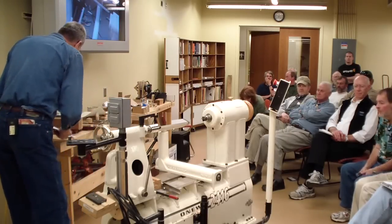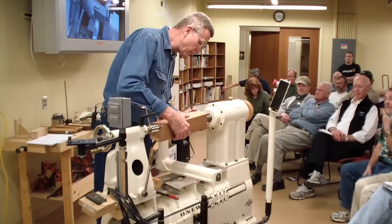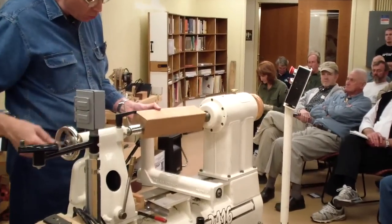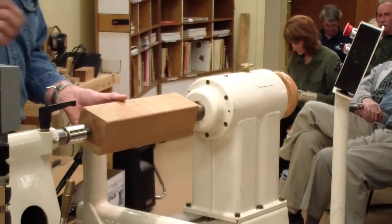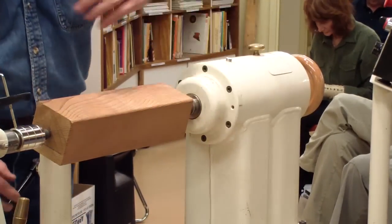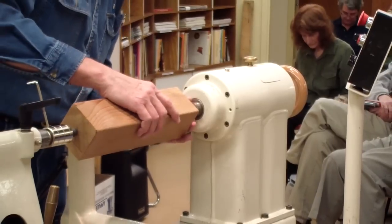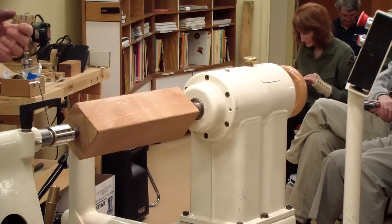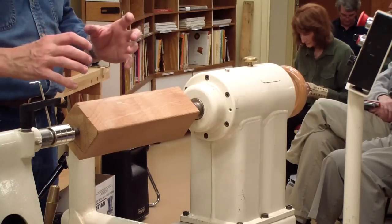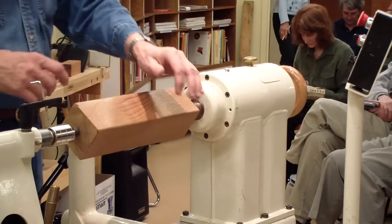Have you used the same type of gizmo with the bolt steady? You can modify the bolt steady to do some of this. And if you look at some really old wood lathes, all they had was two wheels back there. They actually had another saddle and a post in here that had two wheels. They just slid forward, that was it. That was pretty much for the big heavy timbers, so that it just took the harmonics out of it. Because the two wheels were here, this is turning, it's still allowed to bounce up, so you still have to hold your hand on it.